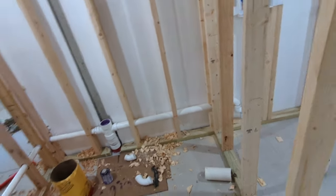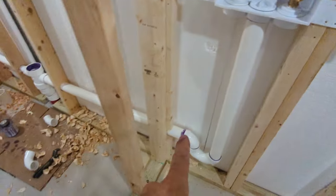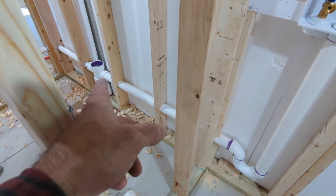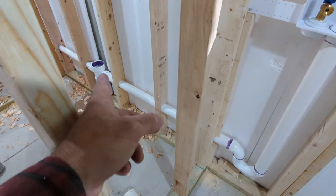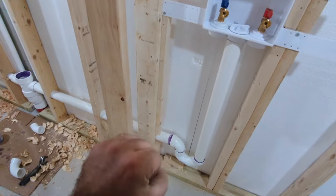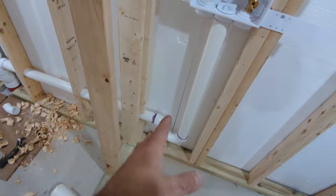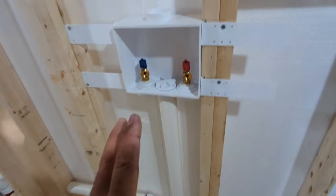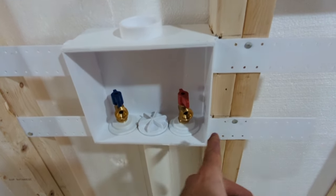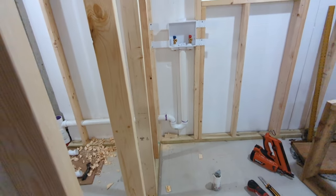So, we're to that point. Now, I took a little out of the lumber here because of the stack up. Again, I've mentioned this a million times, I don't like to dry fit with or without primer, certainly not with primer because the primer can glue it by accident. I didn't want to dry fit this length just to make sure that this was going to come in plumb. So when I rammed everything down there, it was tipped to the left a little bit out of plumb. It was right against that seam, which again, you won't see in the end, but I'm a professional. This way it's just a low key notch, and I pulled it over and so now it's very close to plumb, far closer to plumb.